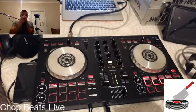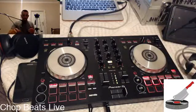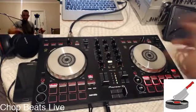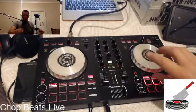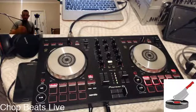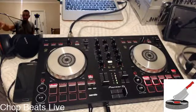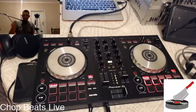first off, stop playing, turn down the master volume on your amplifier, so the very last thing that can receive signal is your amp before it goes to your speakers. So you want to turn that amp off completely. So volume fully down, then off. Then turn off the last bit of the soundstage before that. In my case, in this environment, that would be my mixing desk. So turn the master fader down so there's no output, then turn it off.